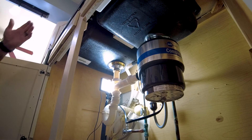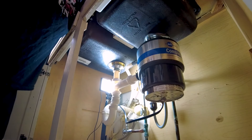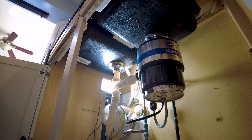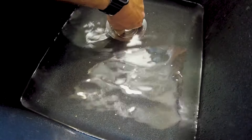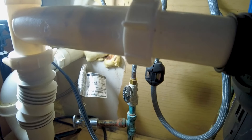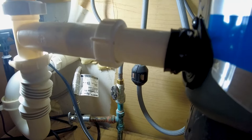Now that I'm all done, I'm going to take the stopper and fill my sink up with water just to make sure that when a lot of water drains down — like if you dump a pot out — it's sitting in there for a second and it's not going to come around that seal. I've got a lot of water in there. I'm going to let that sit for a second and look right around here for leaks. I don't see any leaks. I'm going to go ahead and pull the stopper — you can see the water rushing through. I don't see any leaks at this flange and the water is just draining right out. Good to go.